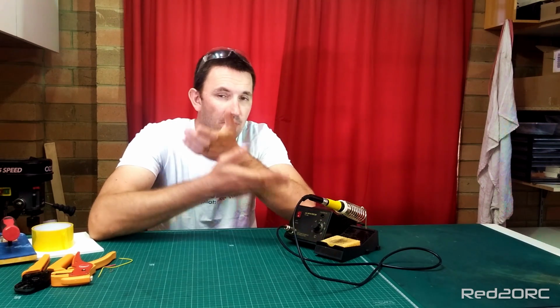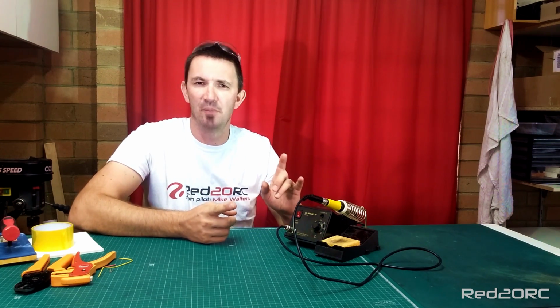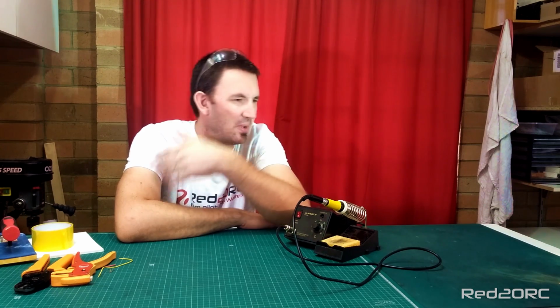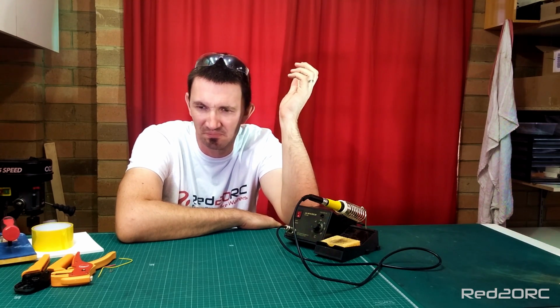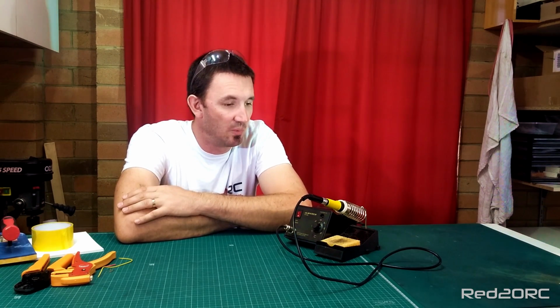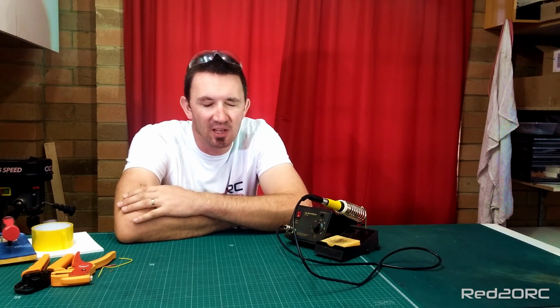Okay, so number 1, the soldering iron. Yeah, it's pretty obvious. Everybody's going to need one if they want to get involved in this hobby, sport, industry, whatever you want to call it. But the important thing here is a good soldering iron. I have spent countless hundreds of dollars buying those all-in-one soldering pens. I've bought battery-powered ones, I've bought lithium-powered ones, I've bought all kinds of different ones, cheap ones from Bunnings, the lot. And they all blow up anywhere from 1 week to 3 months. So eventually I went out and I got myself a proper soldering station and I've never looked back.